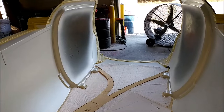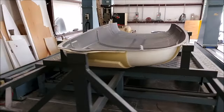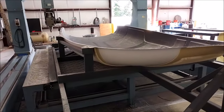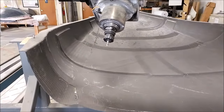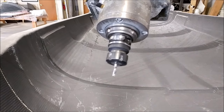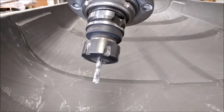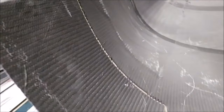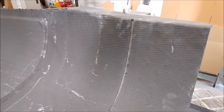Here's the lower fuselage in the jig, back up on the machine so I can begin trimming the flanges off and cutting out the various doors. I've got the quarter-inch acrylic bit — the same type we used for cutting the windows — and just running through doing a swarf cut on where the edges are. You can see the trailing edge being cut. It does go through bits if you don't keep them cool.